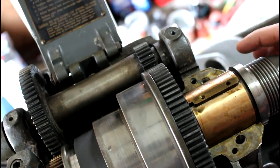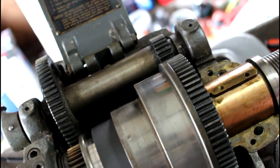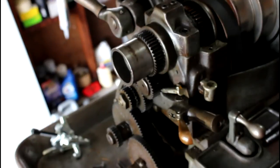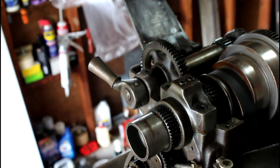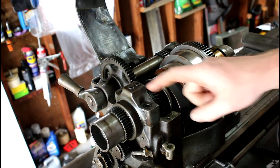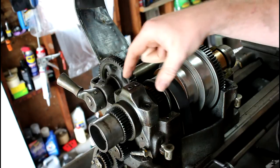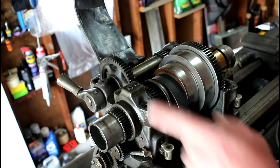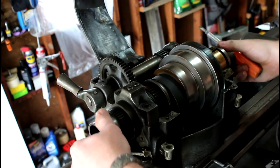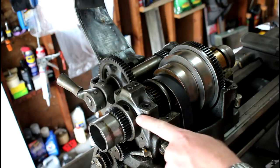These shims are supposed to be equal on each side. When you're shimming, that's a whole different story, but they're supposed to be equal. So the same thing on the second one — you do the same thing on this guy. Take the caps off, take the screws out, bearing cap screws, and this should pop off. One more thing too: you do have to loosen your thrust or lock bearing here — lock washer, whatever you call it — you've got to loosen that guy up too.